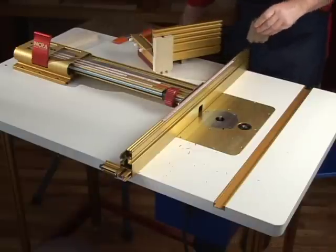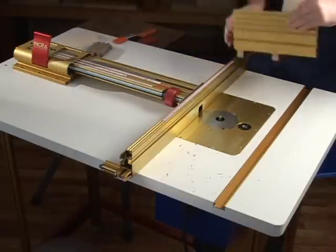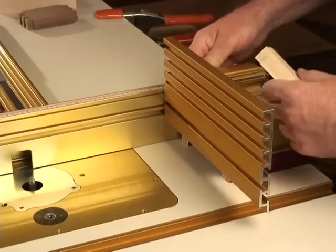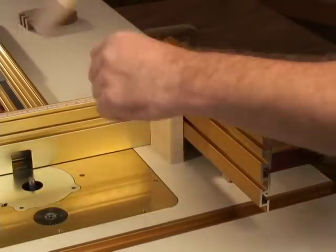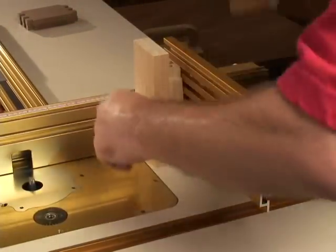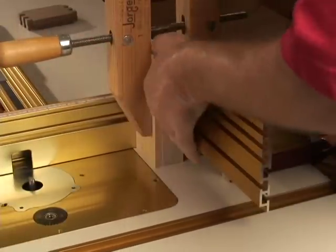Next, we'll make the B series of cuts on the remaining two pieces of stock. Clamp the right angle fixture to your fence and table and flip the backing board over to present a fresh backing surface. Add the two pieces of stock and securely tighten the wooden hand screw clamp. Remove the spring clamp.